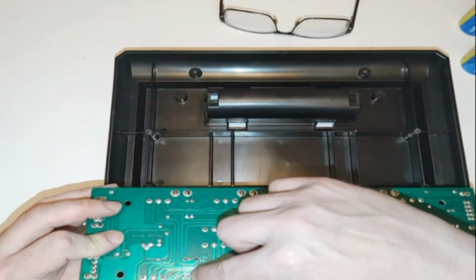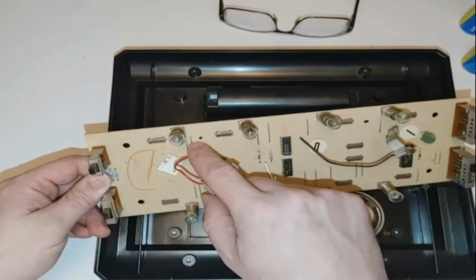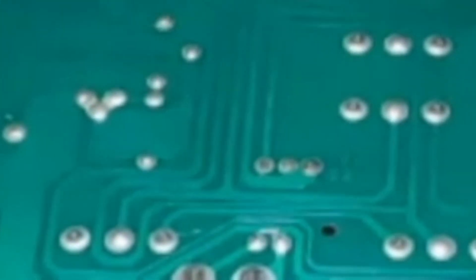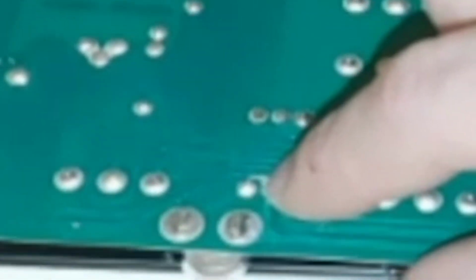these two tails that are coming out of these jumpers right here, see how they were on this trace right here and cutting into this trace. So when you screw this down, it was hitting the plastic and pushing those tails or whatever you call them for those jumpers into that trace right there, guys. And that's what was causing the short.